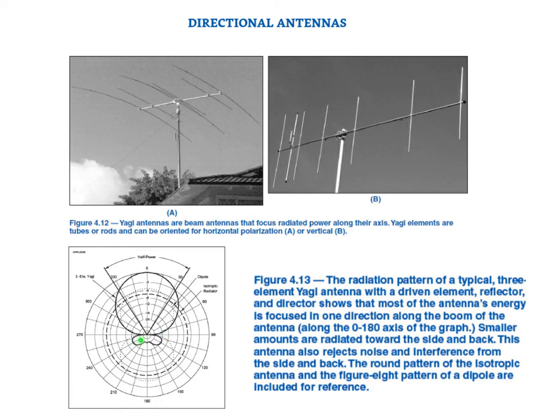And then this is just another look, bird's eye view or the drone view, of what the radiating pattern of an antenna of this type would be, where the radiated energy is primarily concentrated in a big lobe out front with not much going on behind it. So you see little lobes here, but that's not much power. So this thing can see in this direction real well, but it's kind of blind back here. Won't hear anybody back behind it.